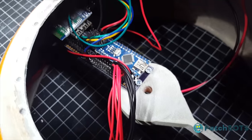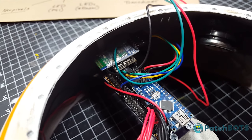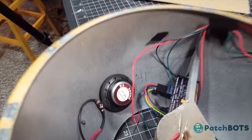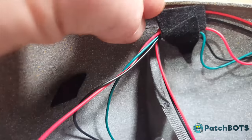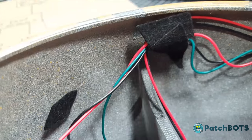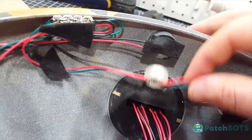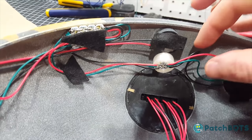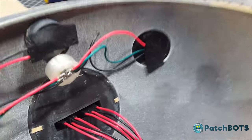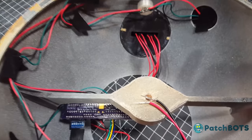Looking in from the top of the droid, I have the Disco module mounted to the main crossbar with two screws, and the HC-05 Bluetooth module glued to the top of the Disco Droid unit. The TT-25 transducer is hot glued to the side wall just opposite the hololens area to counter the weight. The NeoPixel string goes to the side blue logic, over to the two side logics, with everything covered in felt tape to eliminate light bleed. I also have a backup PSI attached to the NeoPixels, and the NeoPixels terminate at the hololens. Coming out of the radar eye I have 6 red LEDs for animation.